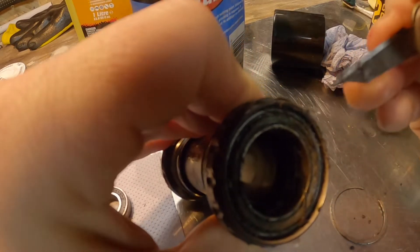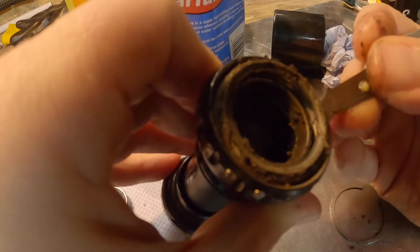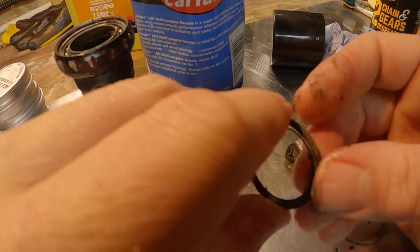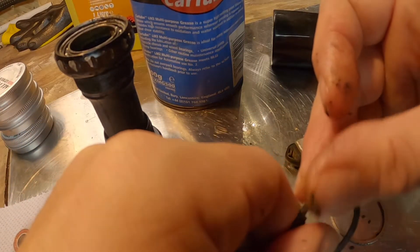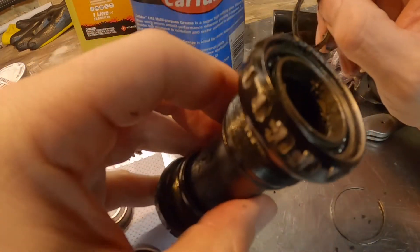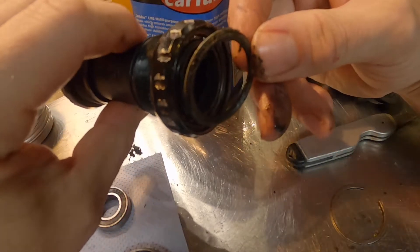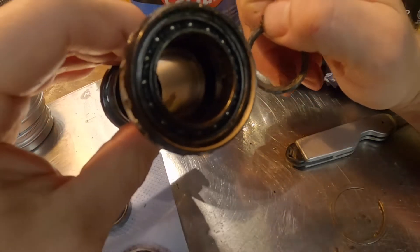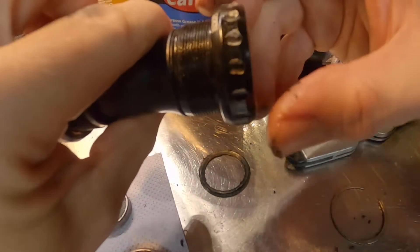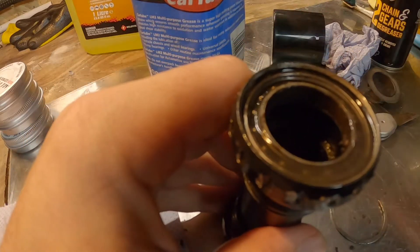I've been away and cleaned that. As you can see — let me just spin that one more time — we have a fairly free-running ball race. You can see the individual bearings within there. This assembly has actually got a plastic race to keep the ball bearings in place front and back. They often had those in the old days — when I was a boy they used to be metal, but we've got more advanced materials now. So that is now cleaned and ready for a little bit of grease. I've thoroughly dried it and got rid of all traces of cleaner.